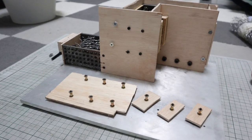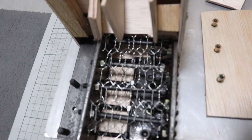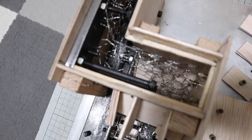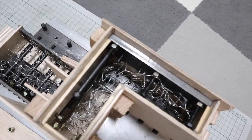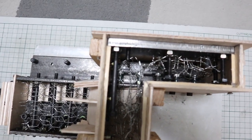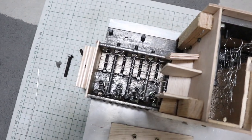This is the formwork I made. First I would like to explain a few important points about epoxy granite. Unlike metal, epoxy granite can't be drilled with threaded holes, so some metal must be embedded where machining is required. Therefore bolts and other components must be embedded in the epoxy granite so that the metal becomes an integral part of the epoxy granite.